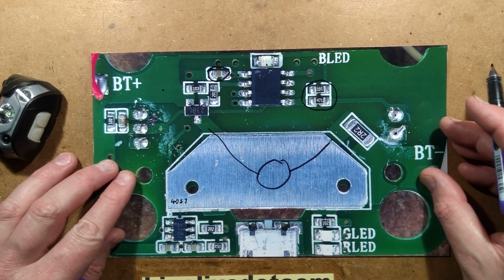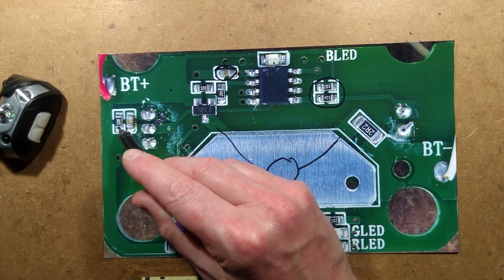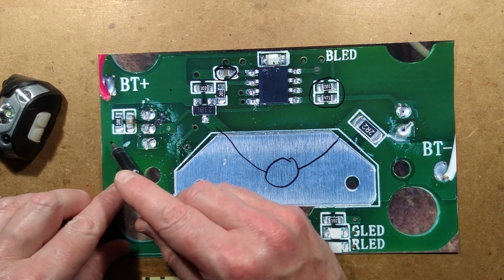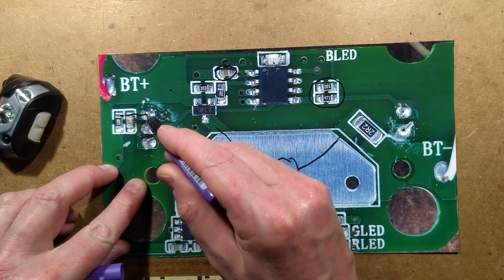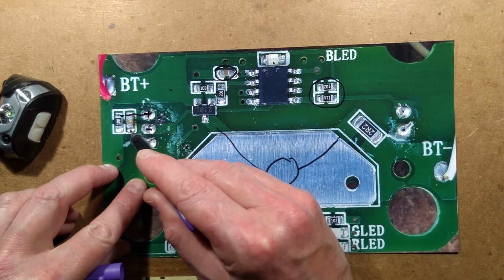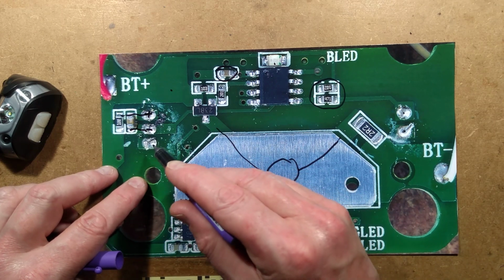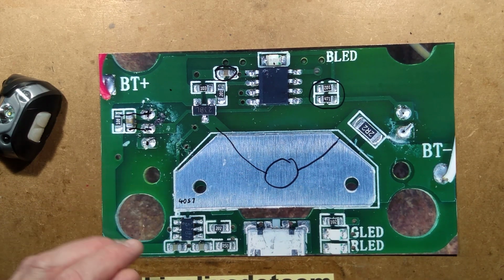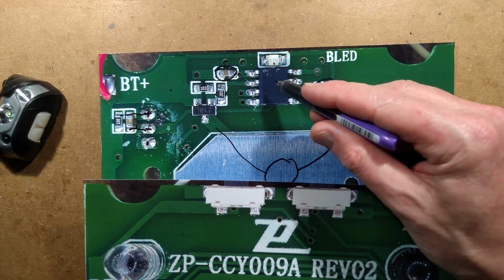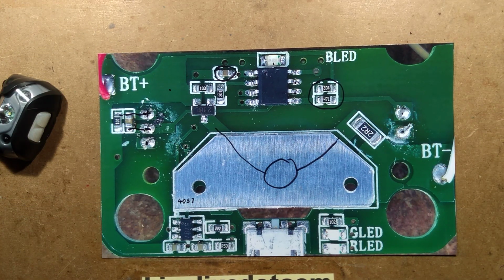And that is it. All we've really got over here is the supply rail with the decoupling. This 110 ohm resistor is used just for decoupling from the supply rail. It's going from the positive rail to the supply pin. This is the positive. That's the negative. With the capacitor across that just to act as a local decoupled supply. And that must be the control pin going to the chip. It is. It's going straight, underneath the chip, so it's going to connect to one of these two pins. And that's it. It's very simple.